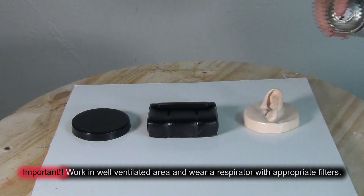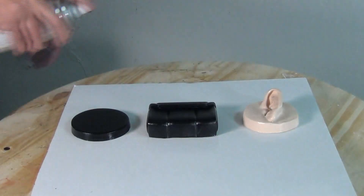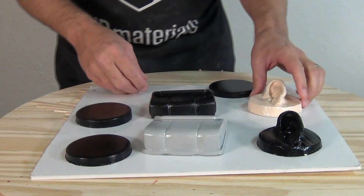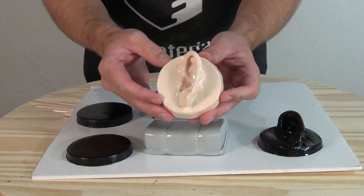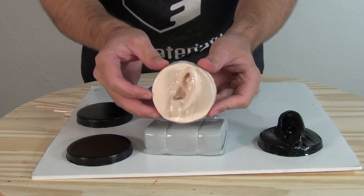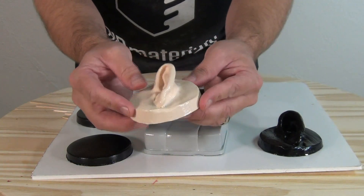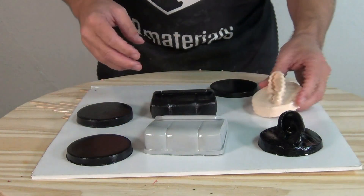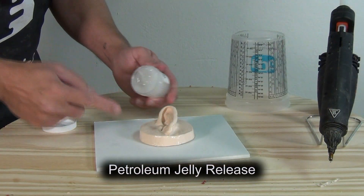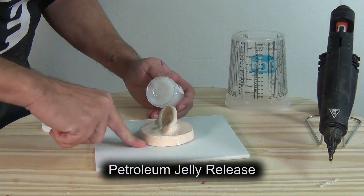Since this is a two-part material it's catalyzing, actually forming a fine layer of resin on the cast parts. That's where we get that nice gloss effect — rather than a traditional lacquer, we're actually applying a very thin veneer of resin over the part. This is after about four or five coats and you can already see that nice glossy effect. I let these parts cure overnight so they were completely cured before I made my platinum silicone mold, because you want to be careful about cure inhibition — but that 2K clear gloss works well with platinum silicone provided you allow it to cure completely.